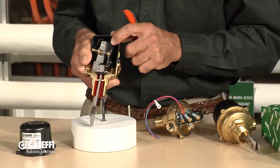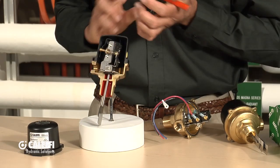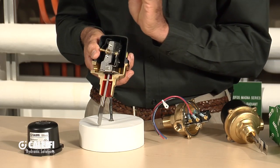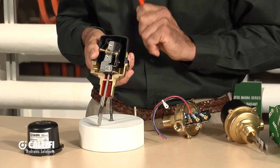Up at the top, we've got a 15-amp, 240-volt rated switch, so we can switch a pretty good-sized load. It's also got a little spring — it's adjustable. Once you get this into the system and fire up your pump, you can fine-tune it so the switch makes at the right flow rate using this screw with the little spring behind it.